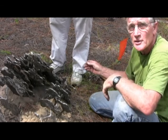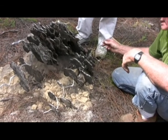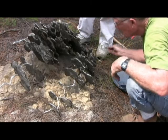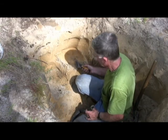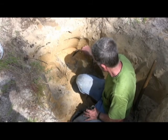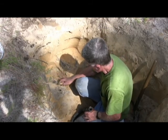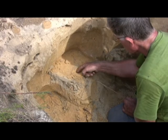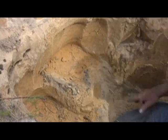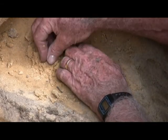You can see what fine features the aluminum cast — those little points are where we had wire flags stuck in the ground and then pulled them out. The aluminum got down about two or three feet, and these are the beginnings of the uncast part of the nest. So we're going to expose these openings and pour aluminum again — we may have to repeat that a second time. That's the only way to get a complete cast: cast it in stages. I found the beginning of the uncast portion and I'm making a little funnel to catch the aluminum and run it down into the chambers.